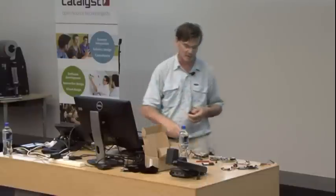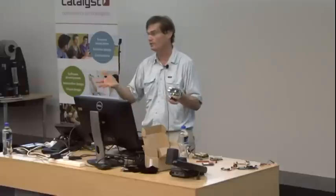One of the points of going to Linux is you move to gigahertz class, gigabyte class systems. So I'm planning to put this cape on an Odroid C1 that I've ordered. This cape is compatible because it uses the HAT standard for Raspberry Pis. The Odroid C1 is a quad-core CPU, really quite fast, a lot faster than the Raspberry Pi. This HAT should fit on it. That would then give me a quad-core one for doing a whole lot of imaging stuff, so SLAM, that sort of thing. And recognising other aircraft in the sky and heading away from them or towards them, depending on your predisposition. Lots of fun things that you can do with lots and lots of different types of sensors, which we're adding all the time.